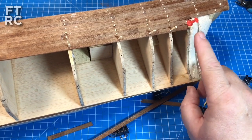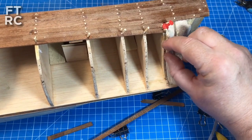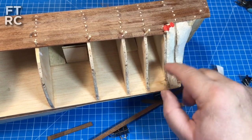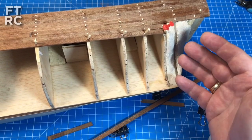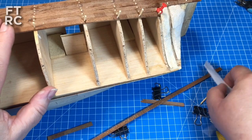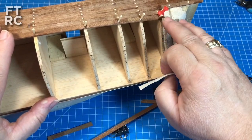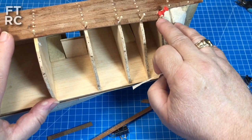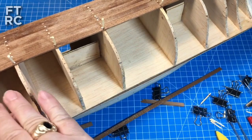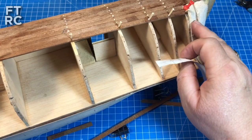So that's okay. If you notice that your section you're going to try and cram it in, and that will happen when we go all the way up here, is less, then you're going to have to start dropping planks, because it's advisable not to go any less than half the width of the plank. All right, now a funny thing happens at the lower section, because sure, we can reduce these, so these little planks here are only going to be basically 3.5mm wide, taper two, over here the same, and then they'll gradually go 4, 5, 6, 6, 5, 4, 3-ish.